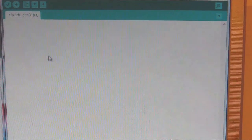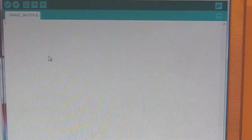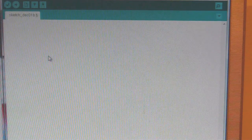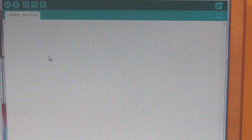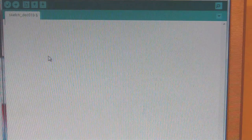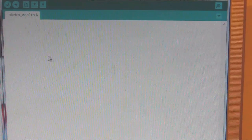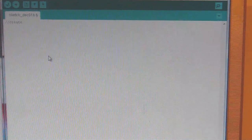I've decided to rewrite the code for you so you can follow along. I'm videoing the screen — I'm working on someone else's computer and don't want to install screen capture software. The first thing we're going to do is create three arrays. These arrays will hold the output values for each LED. Each LED can have an output value between 0 and 255, which is a byte of data. There are three LEDs within each pixel — red, green, and blue — so we're going to create an array for reds, one for greens, and one for blues. It's not necessarily the best way of doing it, but it works.